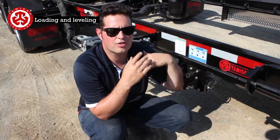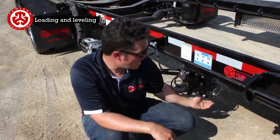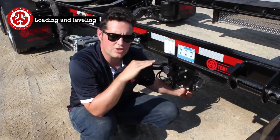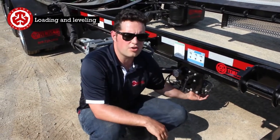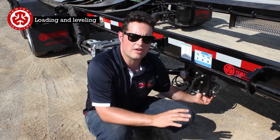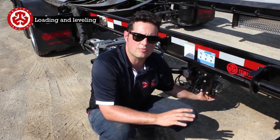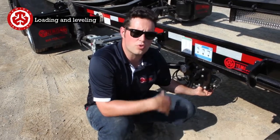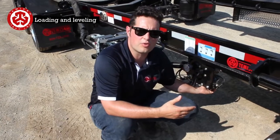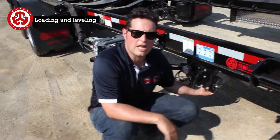So if it's a little heavy or too low at the scales, you have this trick here. You can either use the gooseneck to adjust to make sure that it's even, or you can come here and just cheat it just that little bit. Then you can go on the plate and make sure that everything is weighed correctly. Then you'll be able to leave. Just make sure that when you load up another tower, you remember to adjust this to make sure that everything balances out correctly.